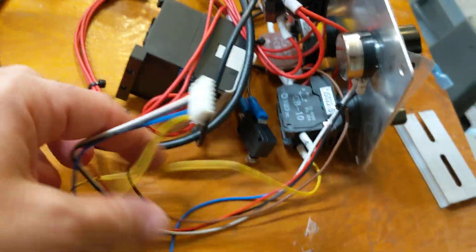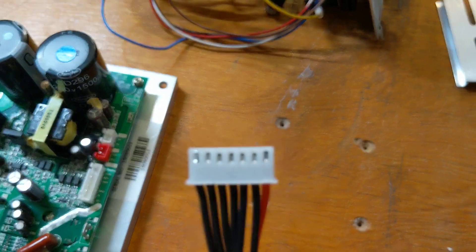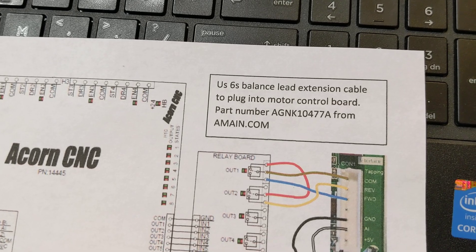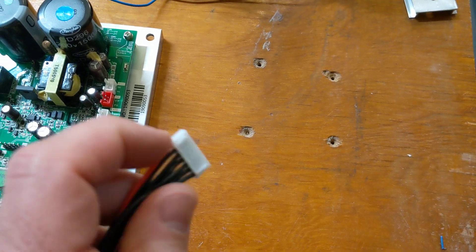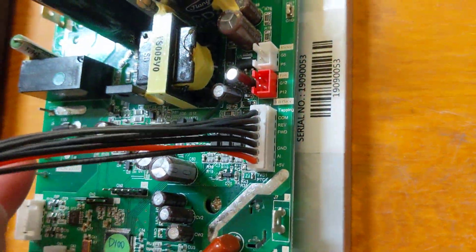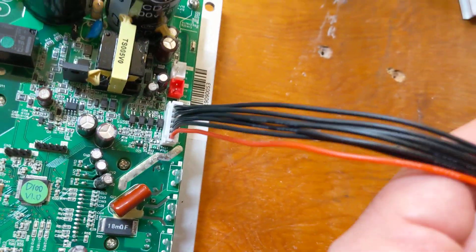The easy way to do this is instead of trying to clip on to these wires, plug directly into the board into this little connector. These connectors are standard for lithium polymer battery charging for RC racing — I put on the diagram a place where you can buy one, cut one end off, and you'll have a connector with leads that just plugs right into the board. It's the safe way to do it: a nice professional-looking installation that won't blow things up.